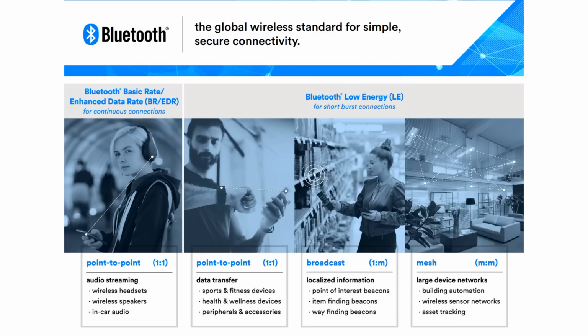Bluetooth Low Energy is a variant of Bluetooth. It is a different standard than the Bluetooth we use to transmit music to our earphones. Its primary application is short-distance, low-energy transmission of data. Like Wi-Fi, it operates in the 2.4 GHz band and therefore needs only short antennas. BLE has many features and today we will just scratch the surface.